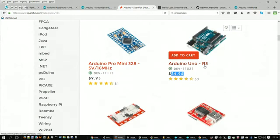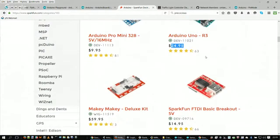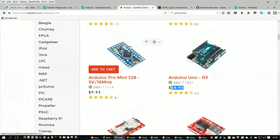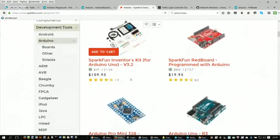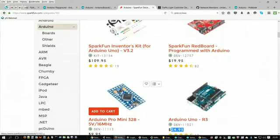You probably wouldn't want to use one of these minis to drive big actuators and switches in something a bit more industrial because it probably couldn't handle the current. But the Arduino Uno or something a little bit bigger would probably be able to handle those amounts of current and that type of thing. Okay. So yes, and actually you can see that even at this size, it's not really easy to see what size this is compared, but there are actually people that take these minis and I think they even have an Arduino Micro, I think they call them.